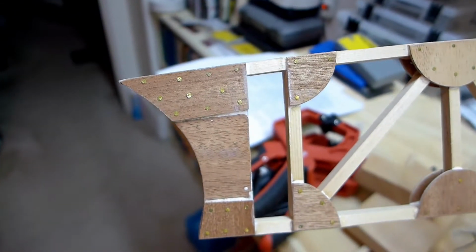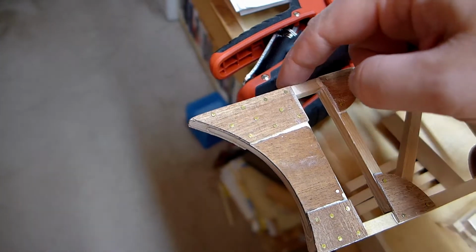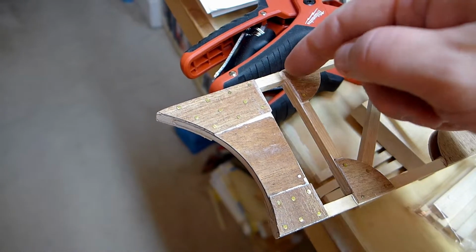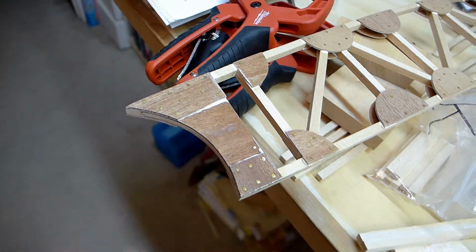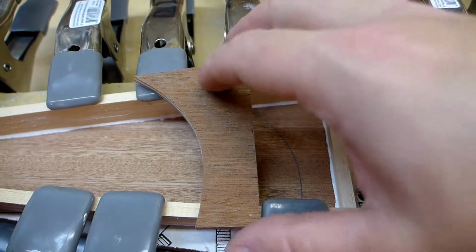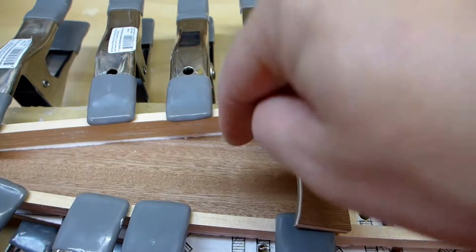You can see there's a piece of sheet metal, aluminum sheet metal, that takes this shape. It comes up over the top, it goes back, down, and then back up here, and it just hooks over the leading edge, or the front of the spar. And the aileron fits into that shape. And I'll glue this on the other side of this, and that'll be the last one that the aluminum hooks onto, next to the aileron. So the aileron will be on the other side of this piece.